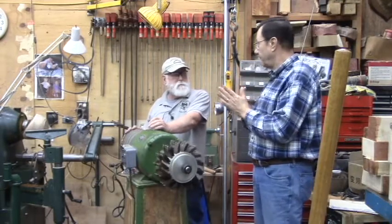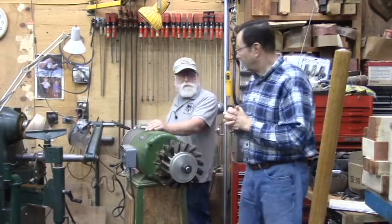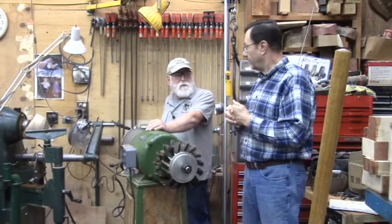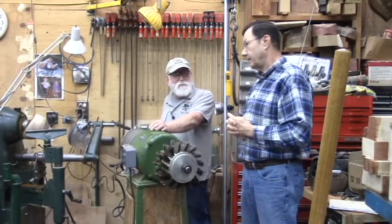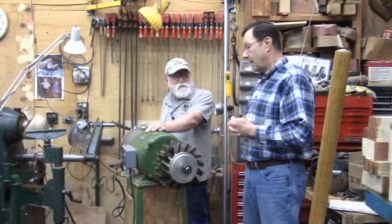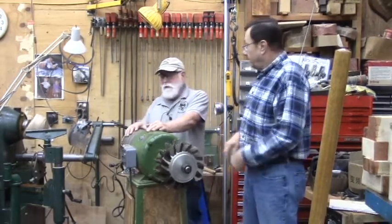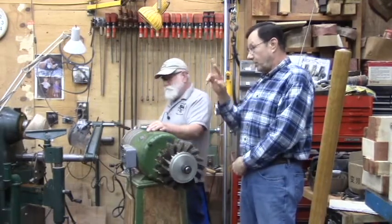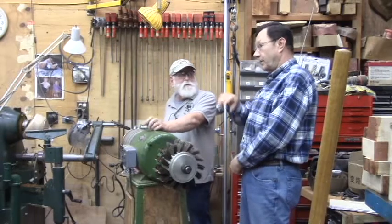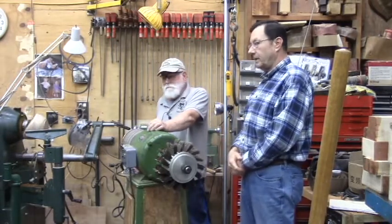You're talking VFD American price, made price? Just in general. Well, this one is a 2 horsepower for 70. Yeah, and you can get a 3 horsepower for just about the same price, $63, $64. Shop around because you just never know. The input voltage is what I was trying to make. Yeah, the input voltage. There are some 110 volt input VFDs, but they're not the norm.